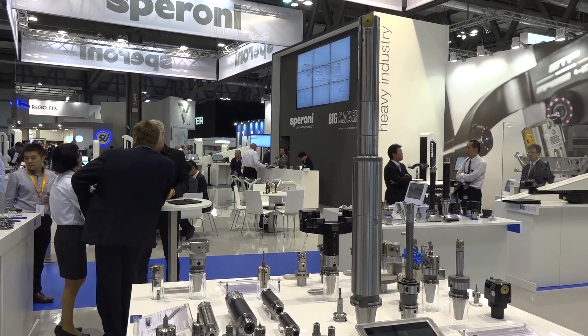The tools we can see behind us are approximately 300 millimeters. What if I need to go further than 300 millimeters? Our tools all come with the Kaiser well-known CKB modular tool connection, which has been in existence for more than 20 years. Because of that modular design, it can be combined with virtually any spindle interface in the world, and extension adapters can be added to make the tool even longer — we've seen tools as long as 500 to 600 millimeters work very well.